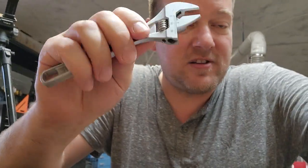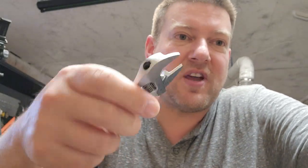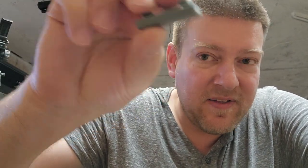What they end up doing — let me get it in the right light — they machined out half of the wrench. This type of wrench is what you need for getting on especially compressed gas fittings. Sometimes there are a lot of little fittings right next to control blocks for even some hydraulics, and you can't get a full-size wrench in between them. One of the things I like these wrenches for most of all is casters on medical equipment.